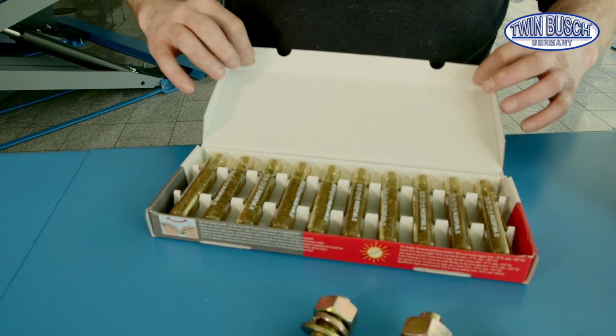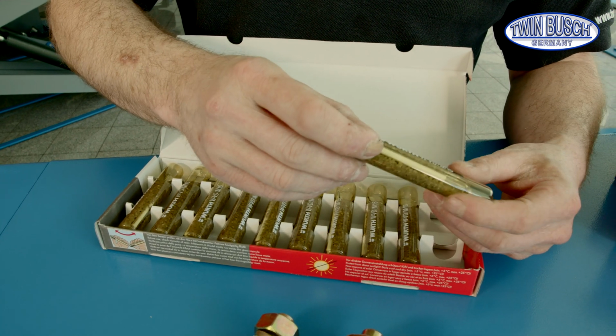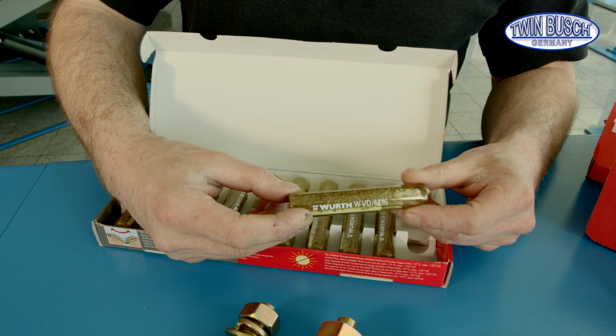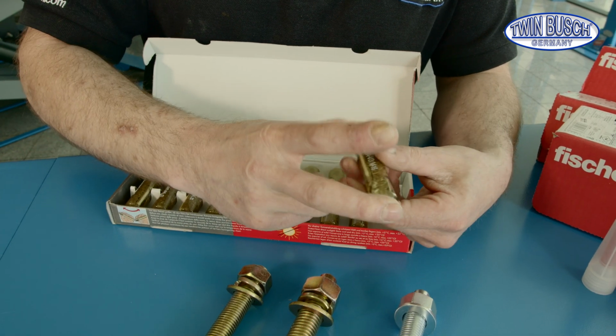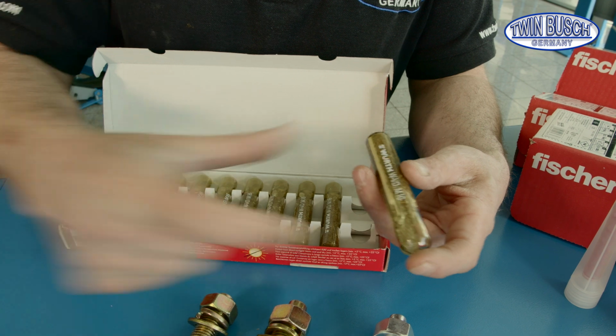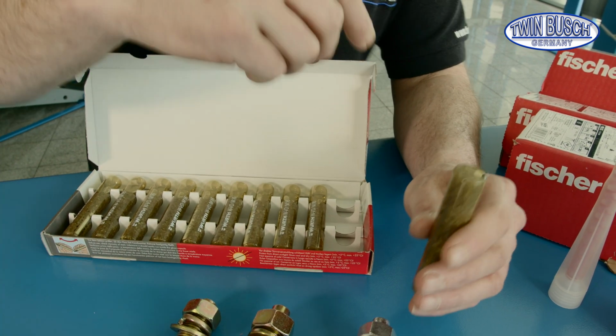Würth also has a compound anchor system with these cartridge inserts. At first sight this is an ideal solution, but it's not perfect in our case. It depends on the anchorage depth. Which means, for example, they only work when I know I want to fix balusters with a 5 cm depth. Then I insert the cartridge.